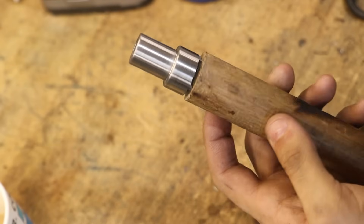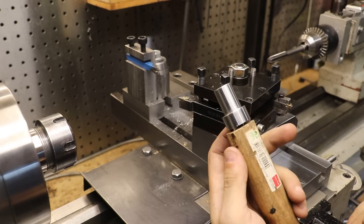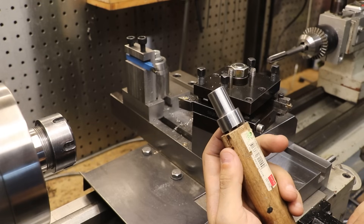Thankfully, fixing it was pretty straightforward. I simply took it to the lathe and removed about two millimeters off the front. This revealed some flats which I just filed down into a sharp point. The center has also been cut down and is recessed a lot further than it was before. It now works a lot better - it hammers in easily and sticks into the back of the dowel. So with the driving issue now done, let's focus on the tool rest.